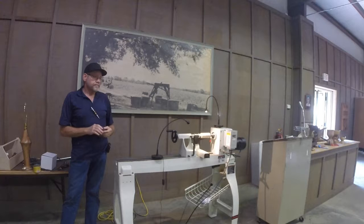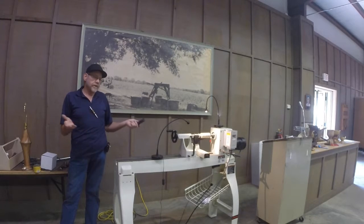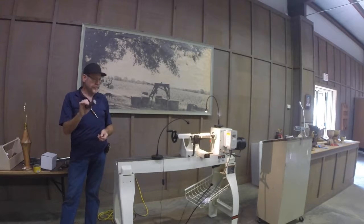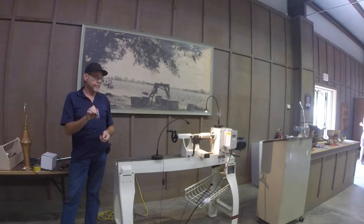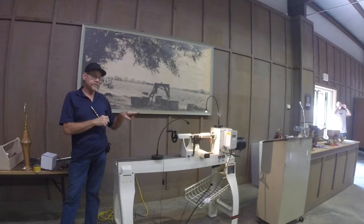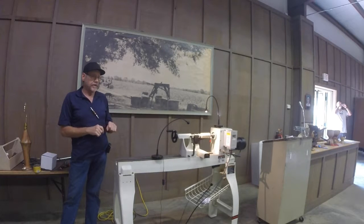You ever tried water putty? I have. How'd that work? I've tried it in natural color. I've never had much luck getting it to take any kind of tint. You know, it's fine if you want it to look like wood. This looks like metal. Metal set will look like metal, but if you don't use metal set, which is two-part epoxy, turn it while it's still in that slightly soft stage and sand it. So all you have to do is final sand it. Because it's got some metal in it, what it'll do is transfer the grain of the wood, the wood dust.